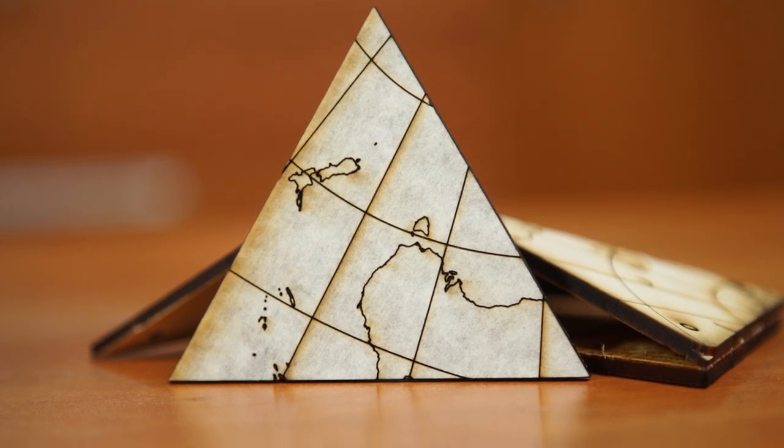So what can we do to minimize scorching? We've had really good success with the presets on the Universal, so that's great. But I finally have upgraded our arsenal. So I got this. Whoa. As we've talked, I already suction cupped it to the table. As we've talked about before, you get scorching when you cut stuff, and it's a good idea to have a protective layer. A lot of stuff like acrylic already comes with masking on it that will help with the scorching. You peel it off when done. But a lot of wood and other materials aren't going to have that, so you'll want to put something on it.